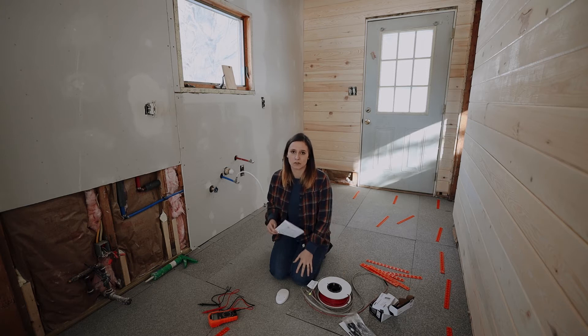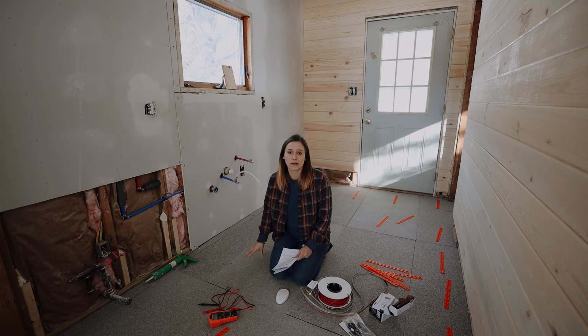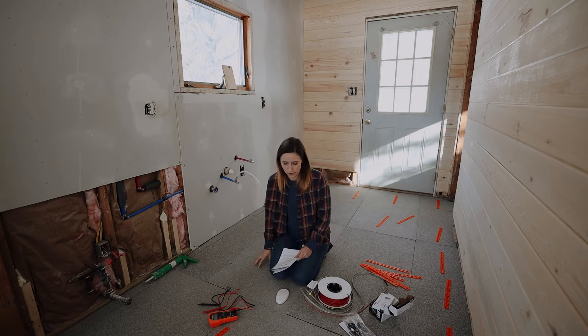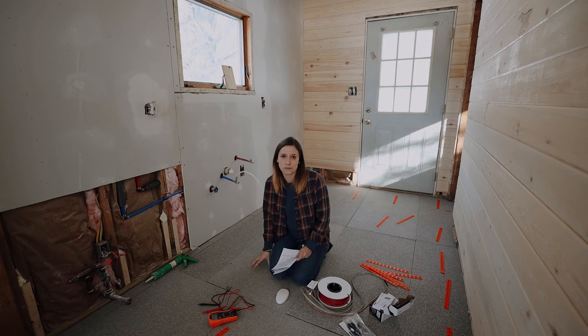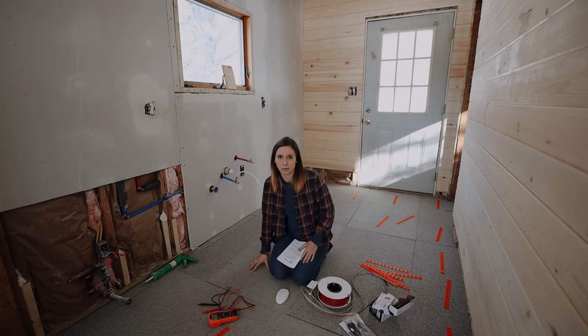When you're laying electric heated floor, you don't want to put your heated floor coil under anything that is a permanent structure, such as cabinets, appliances, or anything that's going to be permanently covered. You can go around the toilet, but not under permanent structures. We started by laying foam as a thermal barrier to separate the concrete from the heated floor element. That way the heat stays above the barrier and we're not losing heat through the concrete.